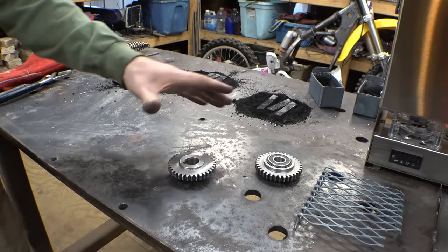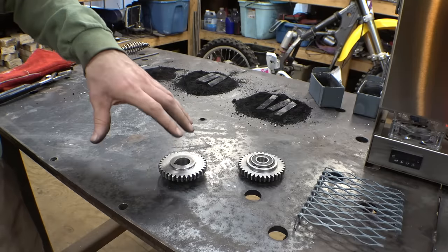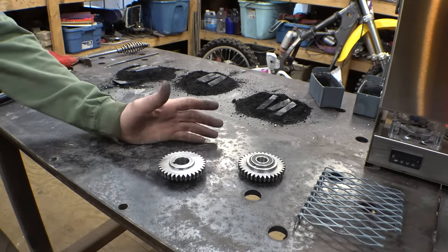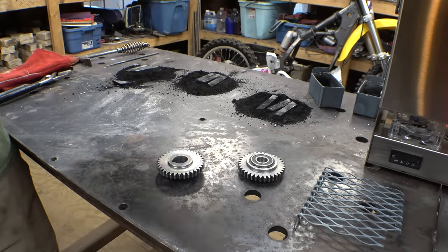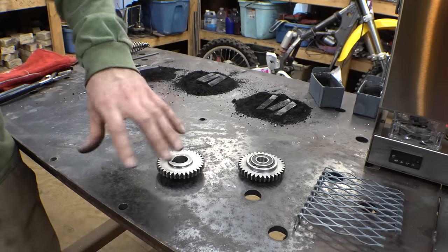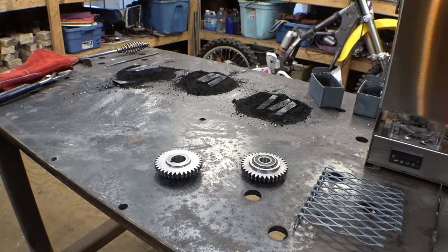Now, actually, before we start heat treating these, we need to start working on making the metal boxes that these are gonna go into, filling them with charcoal and sealing them off, because the mortar I use for sealing takes at least 24 hours to dry, so let's actually do that first. So by the time we're done testing all this stuff and we've figured out how to do this properly, the mortar for sealing these off should be cured, so therefore we can go ahead and case harden these and then heat treat them.